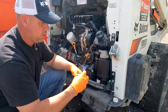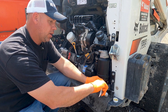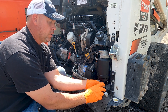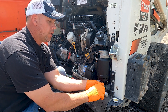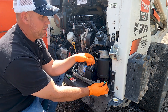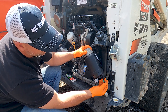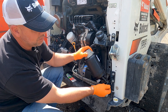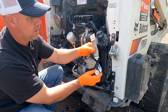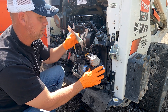I also like to use just a little dab of dielectric grease on the plug for the water-in-fuel sensor because we're always plugging and unplugging this in — every 250 or 500 hours. I recommend 250 hours, and the problem is that seal gets real dry. This helps keep this plug operating nicely so it's easier to pull in and out. Sometimes it's very difficult to get out and hard to get back in. So just a little dielectric grease around the fitting or the plug and the seal itself.